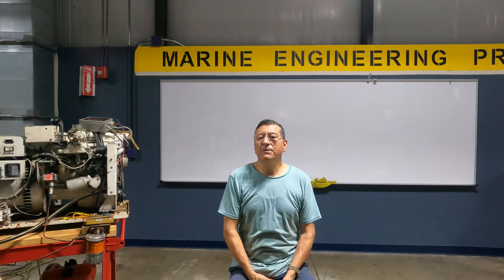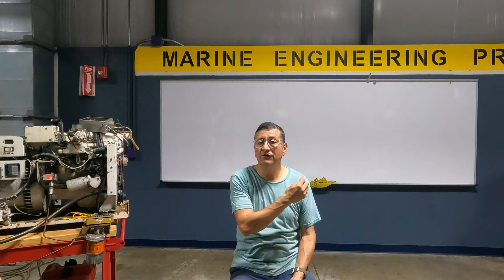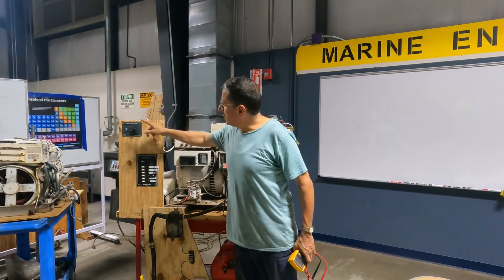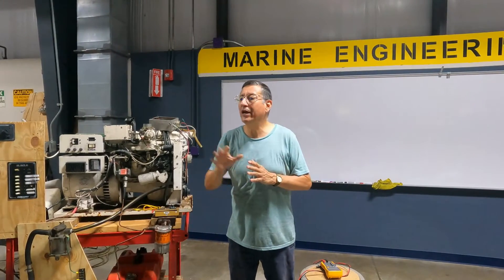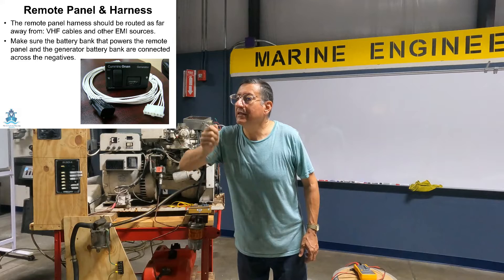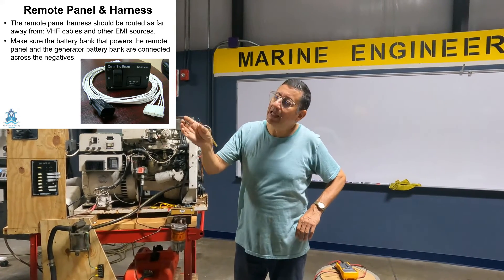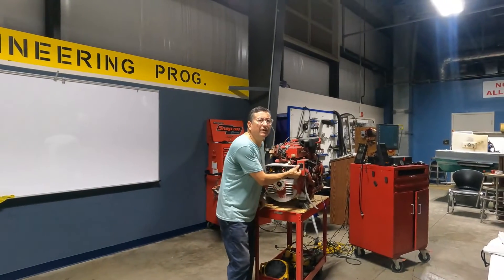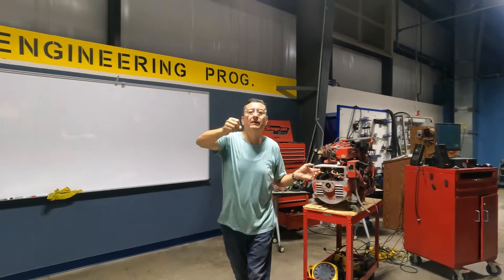This is an ABYC question. Another important thing: you need a good clamp meter. We wired the AC panel, installed ammeters and voltmeters. It's important when planning generator placement to think about where you will route the harness to remotely activate the generator — the start, stop, and remote panel harness. That harness uses only DC cables connected to the generator. The generator has a main breaker, preheat, start, a fuse, and an outlet to connect the remote panel.